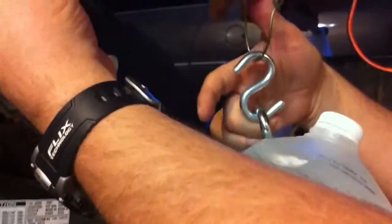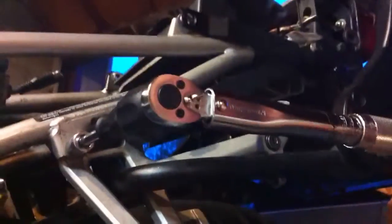So this wrench is set pretty much correctly, so I'm not over-torquing when I'm using the settings on this wrench. I know right around the wrench settings I'm using, it should be about right. It's 180 that it's calling for, and this is 166, so it's right within the framework. Because what happens is, on a torque wrench, it's more accurate as you get up into higher numbers. I have other wrenches for other jobs where it's more intense.